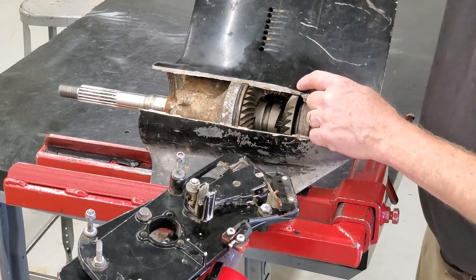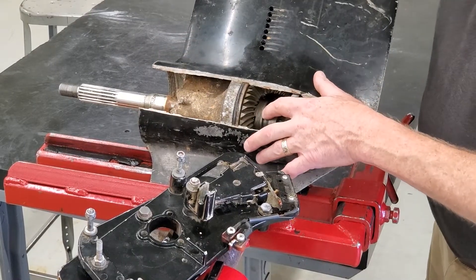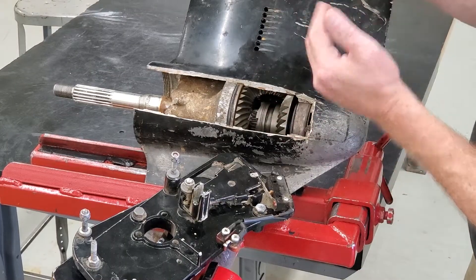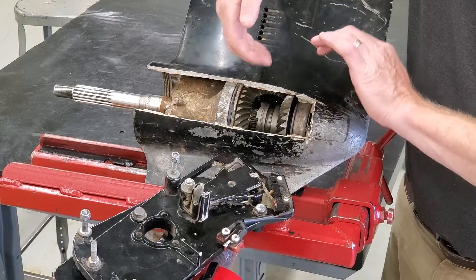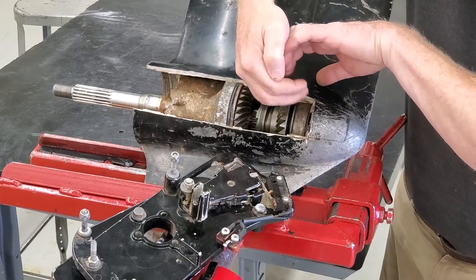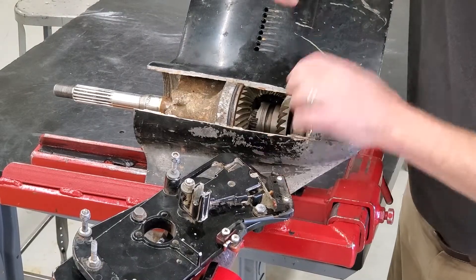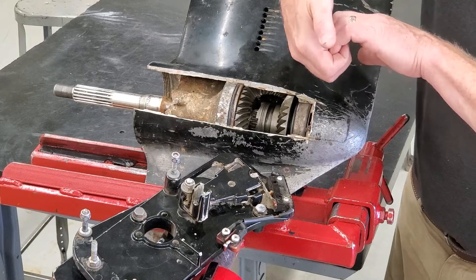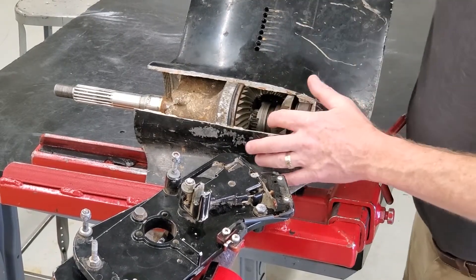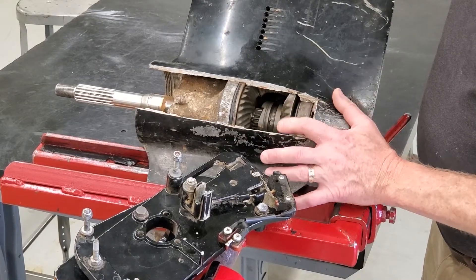Now because the engine is driving the gears, all of them are turning simultaneously, and there's a load on these gears because you have a prop shaft. So to take that clutch and pull it away from that gear, because of the way that the clutch dogs are angled, they interface and come together positively. Basically, the gear is rotating where the clutch falls on it. The clutch is on the prop shaft, and when I engage it, they lock together — they're angled in such a way that they're actually hooked together. Now what I want to do is pull this clutch out of the gear. I need to slide it on the prop shaft, but because these are hooked together, I can't pull it apart. So when you shift an alpha drive into gear, it's a very positive locking mechanism. It locks that gear if it's loaded so that it does not want to come apart while the engine's rotating.